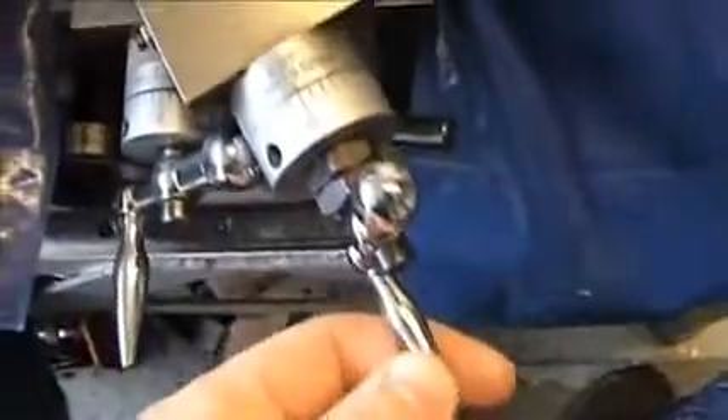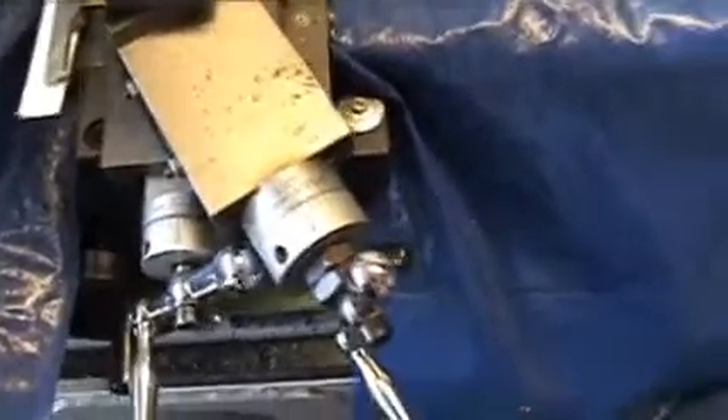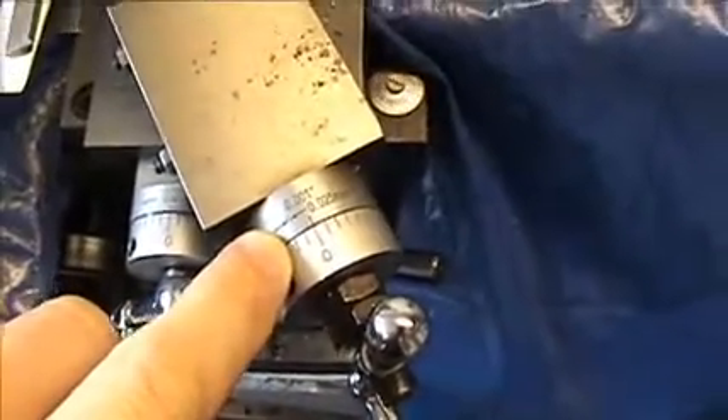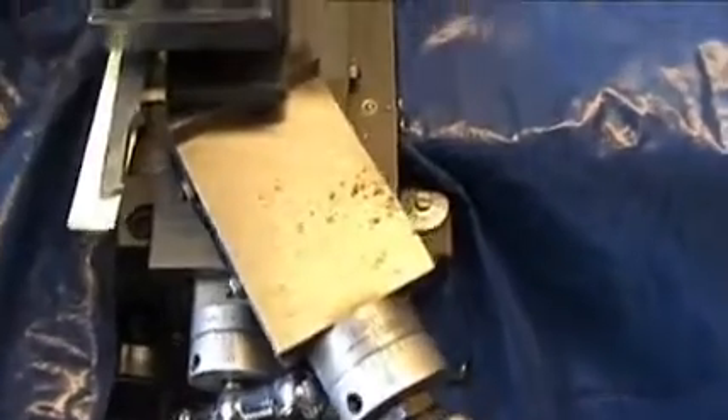Capture on the 12, stop it in the undercut, rewind, move the carriage back on your table handle. Taking another cut off — it's just a case of repeating that slowly. The first few cuts you can move in two and a half marks, and that will go down to two quite quickly, then down to one. It's a slow process, but it does work.